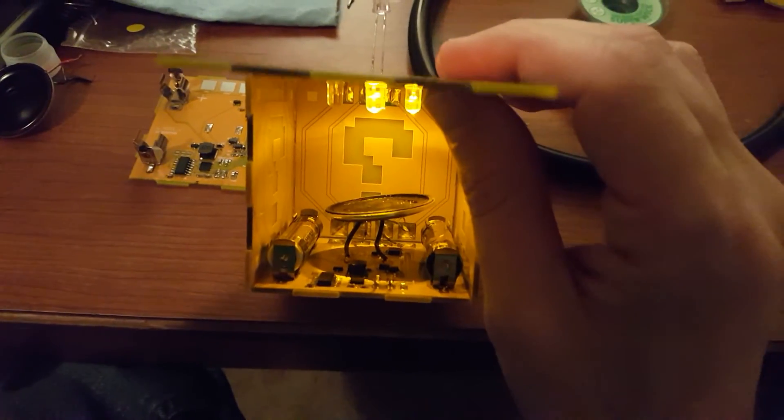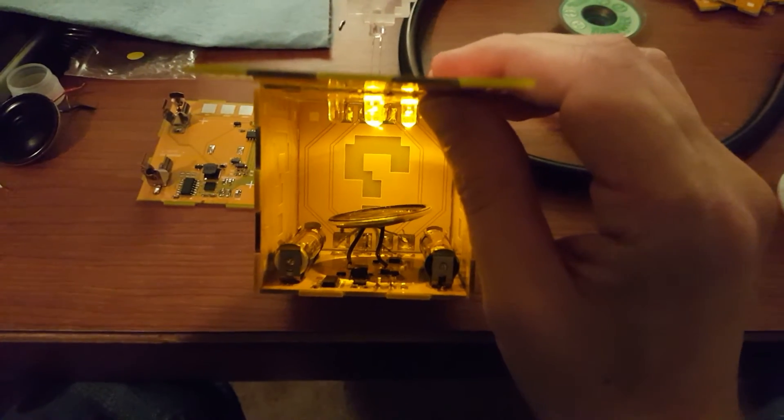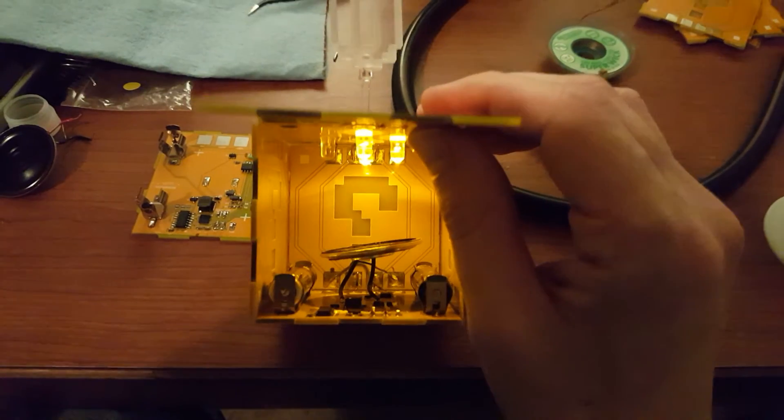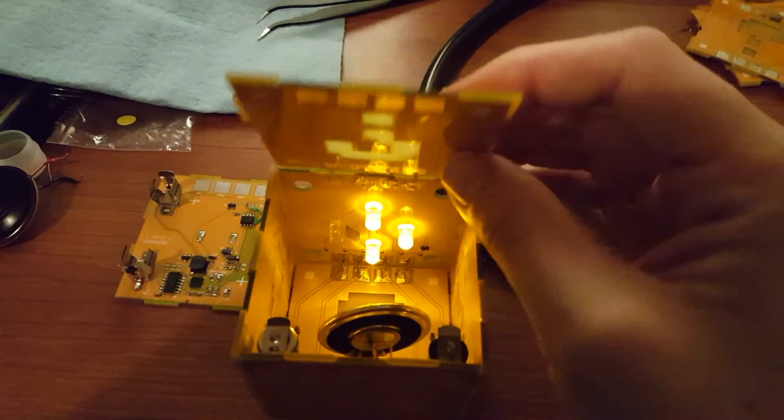I've got some headers that I can use to send new audio files. I have a whole simple file system running on there. I've got the debug headers to reprogram the microcontroller if I need to. And of course we can change out the batteries. Apparently I reverse biased one of my LEDs on there — oops.